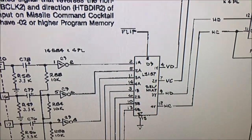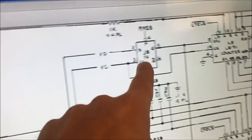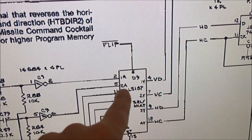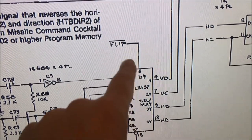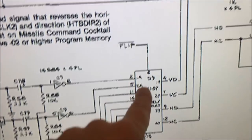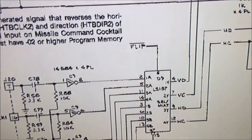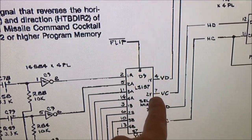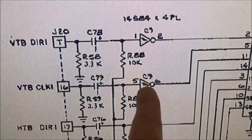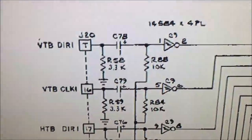So I came back to the MUX. When I moved the trackball I probed all the outputs, and of course pin 7 wasn't doing anything - that's the clock for right here, pin 7 output. So I probed the inputs, which are pins 5 and 6. The select is always selecting 0, so pin 5 should go through the MUX to pin 7 when you move the trackball. But there was never any activity on pin 7 because there was never any activity on pin 5. So I suspected this chip to be bad.